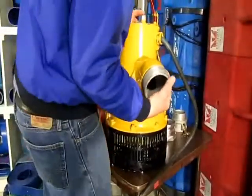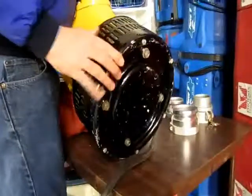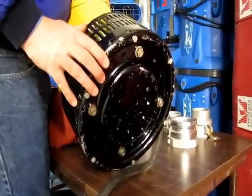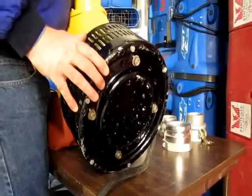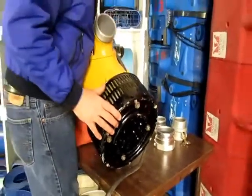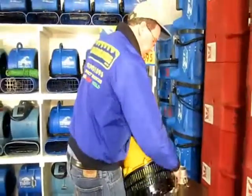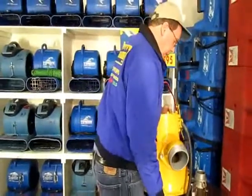But if we're pumping the water right to the floor, we would just wrap this with tape. We've drilled more holes in the bottom, and I've drilled out the bottom of the plate more so that we can pump water right to the floor. We've done this in commercial buildings and it works really well because we can pump a lot of water at a very high rate right to the floor without having to set up a bunch of the smaller pumps.